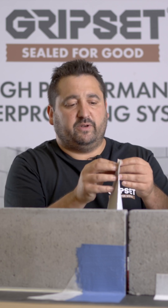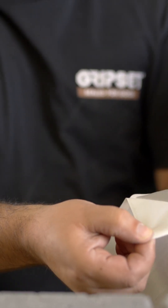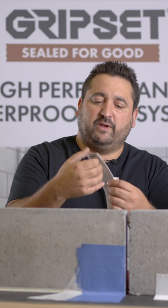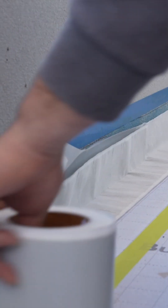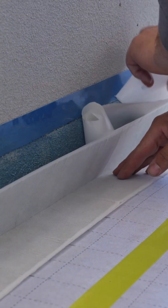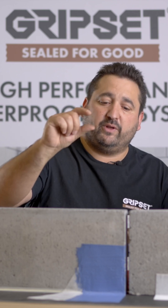The advantages of the peel-and-stick is that the butyl tape — you simply release the backing plastic and then push it into place and away you go. It is self-supporting, so it can bridge voids of up to 20 millimeters, which gives you the advantage that one linear meter would typically do one linear meter, as opposed to the sealant where if that gap depth and height varies, it's anyone's guess how many linear meters you're going to get out of that sausage.